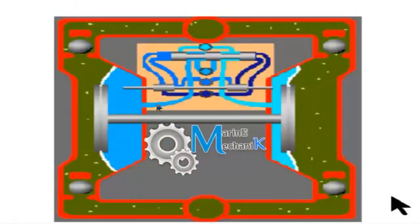Now at this position, the left side of this diaphragm, as I'm indicating here, has completed its stroke or completed the discharge action, and the right side diaphragm has completed the suction action. So the shuttle valve or the main valve opens up, the main air inlet comes through this, and this port is connected, and this goes behind this diaphragm. It's going to push it now. Let's watch it. So air comes and then it's going to push now.